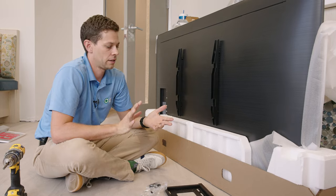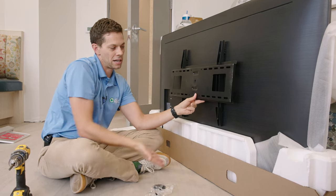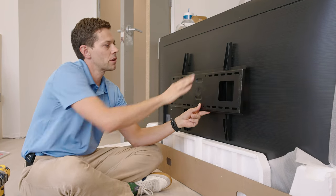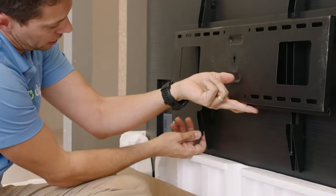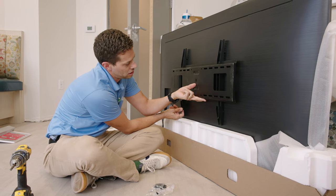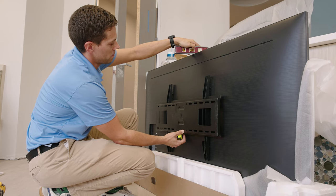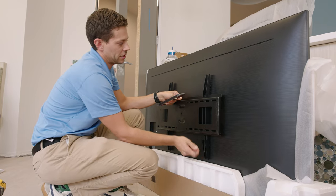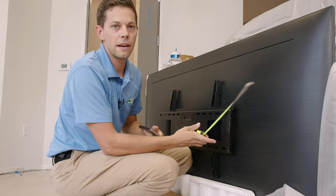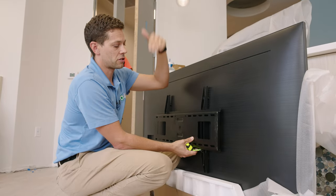One thing I always do is take the wall bracket and hold it up against the back of the TV so I can reference the top. I do this because then I know the offset — where this bracket needs to go on the wall if I want the TV at a specific height. I'll tighten one set screw to hold it in place, then grab a level and measuring tape to get a rough estimate of how far the bracket sits down from the top of the TV. That distance is roughly 11 inches.